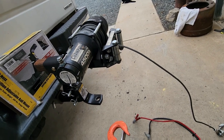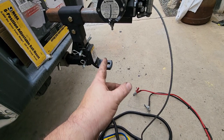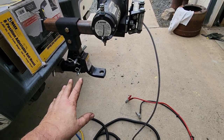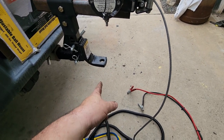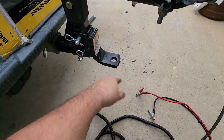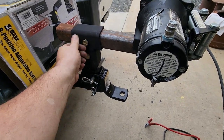My plan is to pick up a non-running car in the next couple of weeks using a car dolly. I need to get a new ball for this hitch — I hate taking trailer hitch balls on and off between hitches. For about 20 bucks, just get the right size ball with a full three-quarter-inch shank, put it on with Loctite, torque it down, and leave it. Same idea with the bolts here — grade 8 bolts with Teflon lock nuts, tighten them down and forget about it.